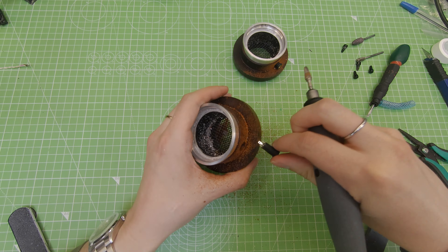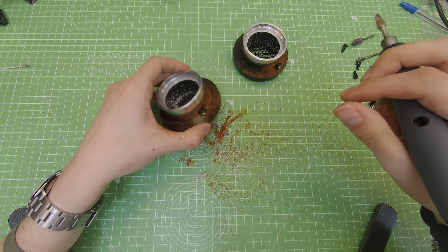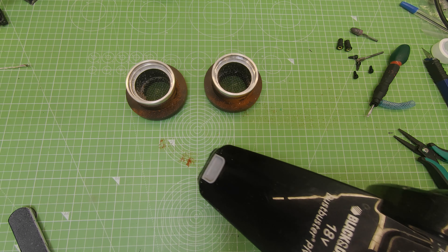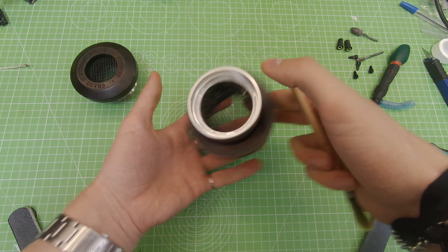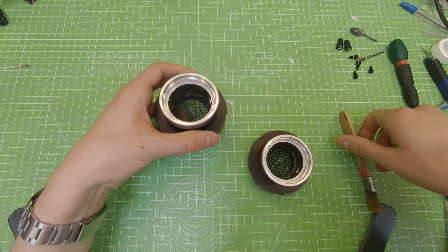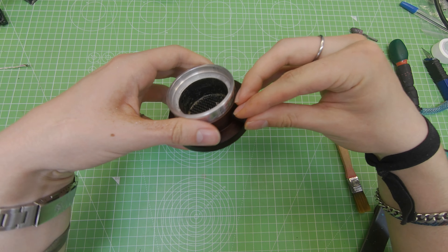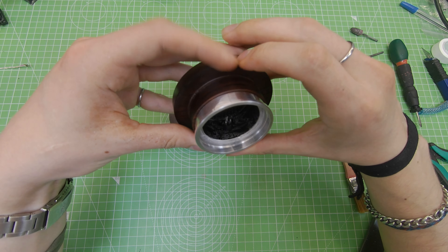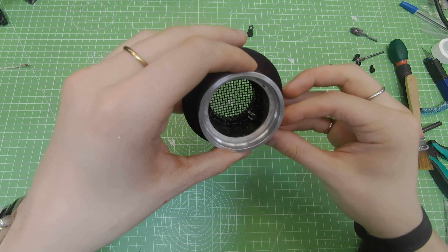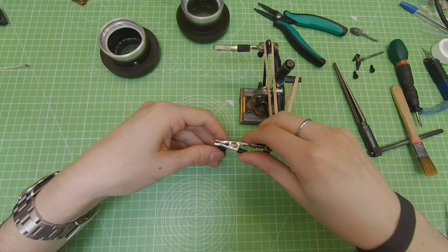We used to use 2.5mm, but it's just a bit small and dainty, and when we can, we'll do a 3.5mm, just because then it's compatible with a lot more cables. So once those both fit, just hoover up the dust. This is horrible stuff — it's all little metal shavings that get everywhere, and you definitely don't want them anywhere near the drivers, because obviously the drivers are magnets and they'll pick up metal shavings. Less so in this case because it's aluminium and it's not magnetic, but with other metal headphones it's worth looking out for. Make sure that they go all the way in, and they do, so I'm just about ready to start soldering the wires up.